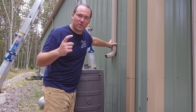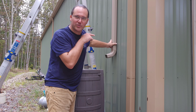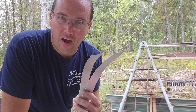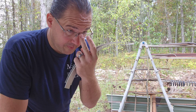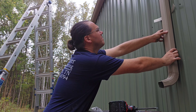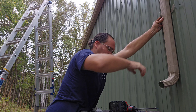You probably don't own downspout pipe crimpers if you're a homeowner just putting one of these in. So mark this — downspout's got two ends: a crimped end and an open factory end. Easiest thing for you to do would be to pull your tape from the crimped end, mark the opposite end, cut that off. Now you've got a crimp that you can put your bottom elbow on. There are a lot of ways you can cut this — green snips, red snips, yellow snips, a hacksaw — whatever tickles your fancy.